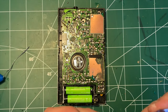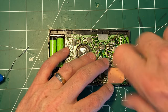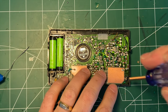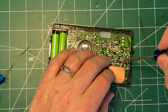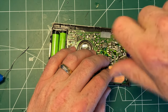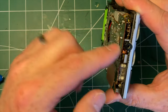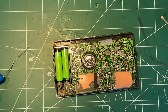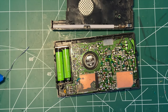Putting the back on this is fairly straightforward. Since I didn't show how I took it apart, showing how it goes back together might be helpful. One screw there, and another one here. All this stuff is essentially held in place by the metal bracket that holds the tuning mechanism. Now I have to fix the battery wire, so I'll find a little bit of heat shrink tubing.